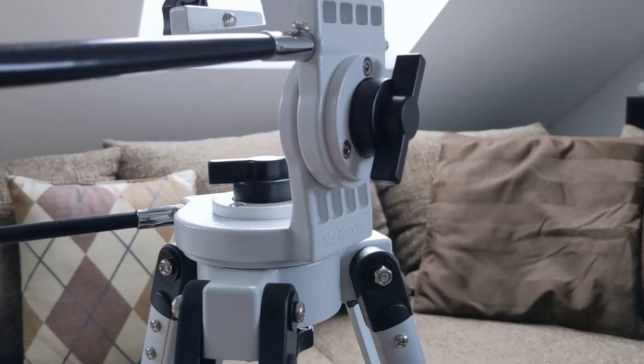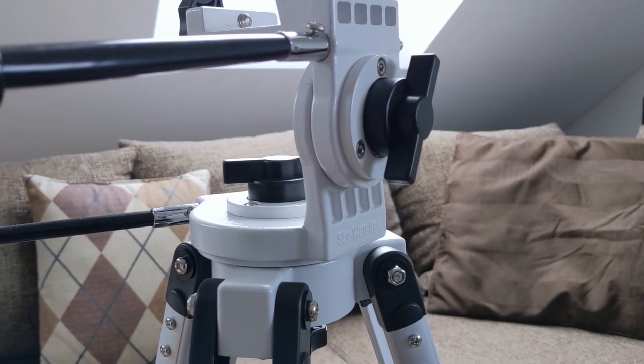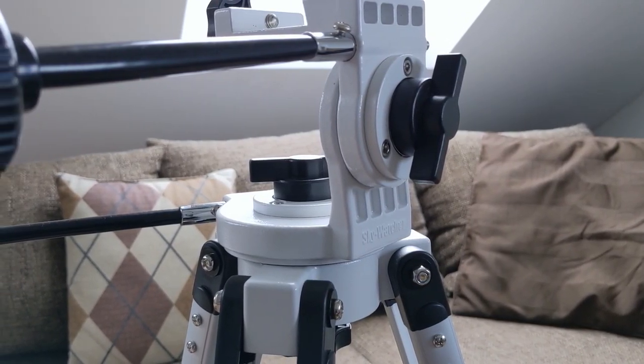Navigation is done using two flexible slow motion rods — one for vertical and one for horizontal smooth and fine motion control. These slow motion rods can be attached on either side so that all telescope types can be accommodated. To enable fast object tracking, there are also two large tightening screws — one for horizontal and one for vertical movement — that can be loosened so that the telescope can be moved freely by hand on both axes.